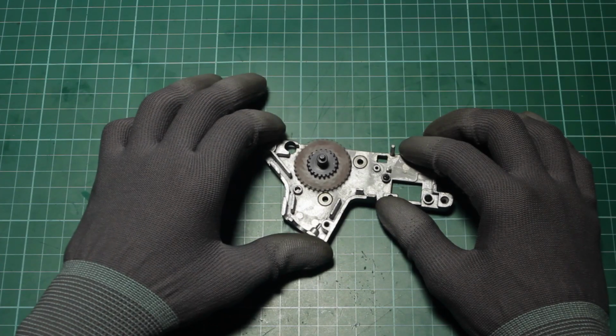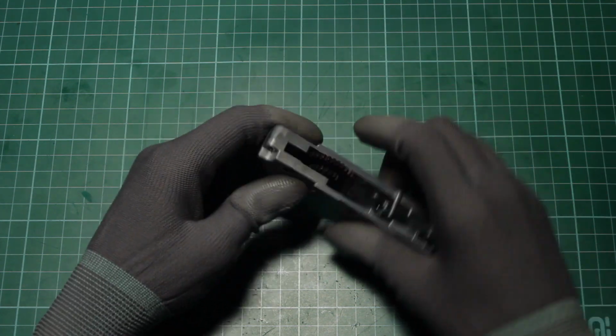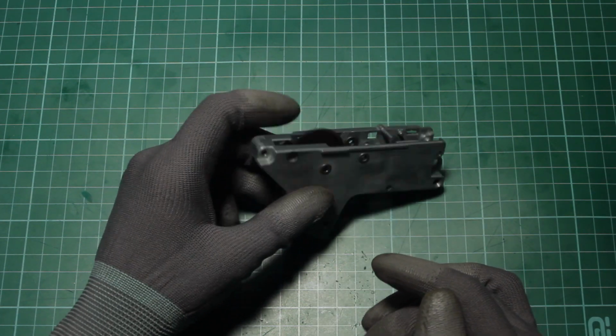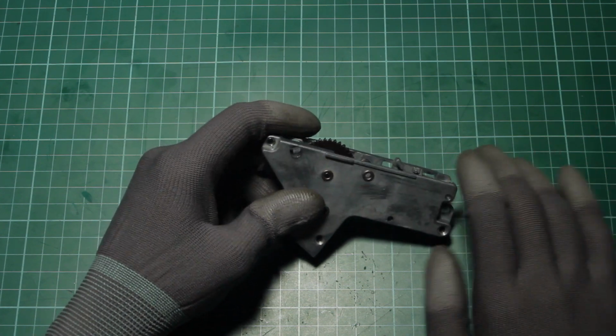Some gearboxes exhibit a change in drag characteristics from when the other half of the gearbox shell and fasteners are installed. That wasn't the case here, and the spur gear continued to spin freely with or without the fasteners installed.